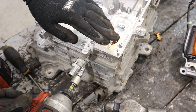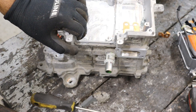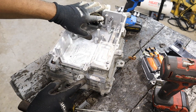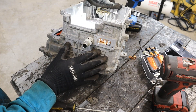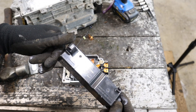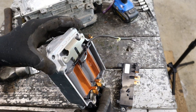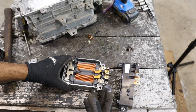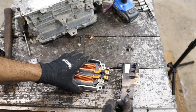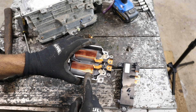Inside of the case where these two bus bars are, I'm going to remove this little cover to get access to two more Torx bolts. Those two bus bars take the DC from this half over here and carry it down into the capacitor in the second half. Taking a closer look at the capacitor, I don't see any capacitor values but it is made by Panasonic and it's got two outputs. Here's what the coil looks like. The reactor works by using the capacitor to charge the coil, which creates a big magnetic field. When you cut power, that magnetic field collapses and gives you an inrush of current — that's what gives you the boost voltage. You can keep doing that by charging and discharging the capacitor and the inductor.